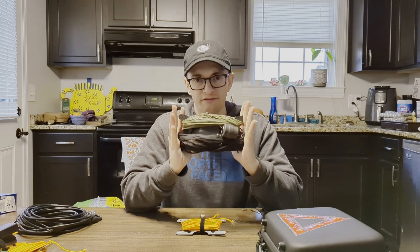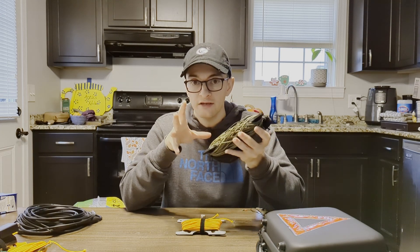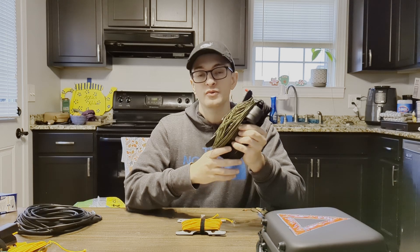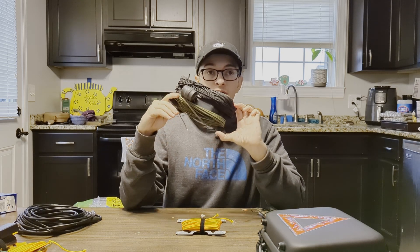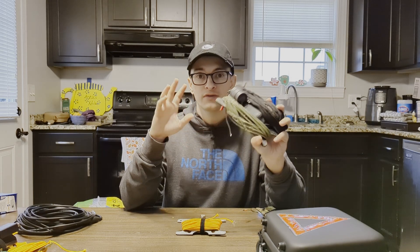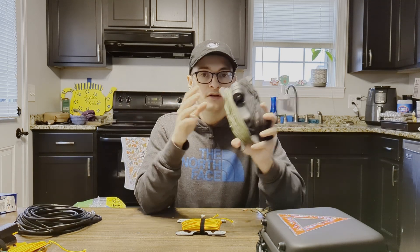This antenna comes in at $225, so that is a premium price. But you can't compare it to base station antennas meant to stay outside all year long, which usually have heavier weatherproof kits that make them bad for backpacking. You also can't compare it to QRP, because this thing supports 150 watts digital where typically QRP is between 20 and 60 watts digital. This antenna would be great for people who love to pack out radios such as the FT-891, because this antenna is resonant on 80, 40, 30, 20, 17, 15, 12, and 10 meters — 2-to-1 SWR advertised in all of those bands.